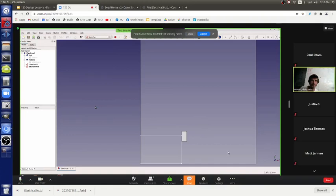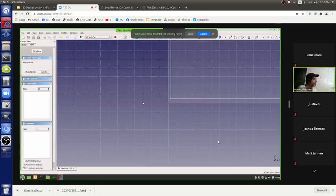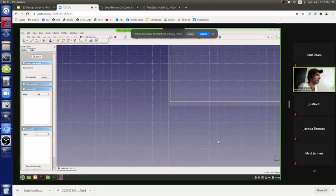Should I make a sketch to vertically space it? Yeah, that would be a good thing. Which corner can you measure against that's a known? Say we want to install this and we don't want to measure anything. Well, we've got the blocking there. Let's put it against the blocking. So you can measure that distance. What is that distance to the blocking? It's 1.5 from the base plate, and then the bottom spacing is 9.25.